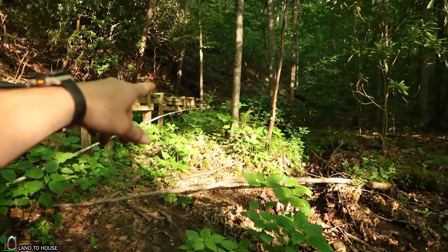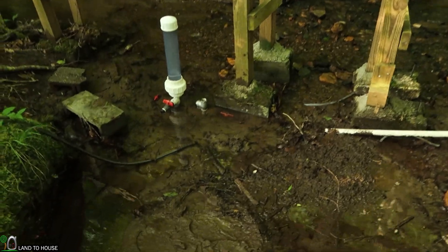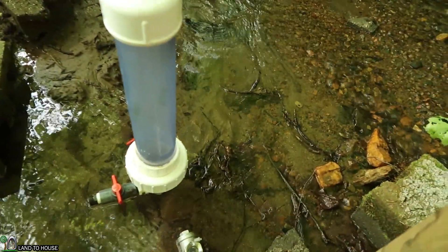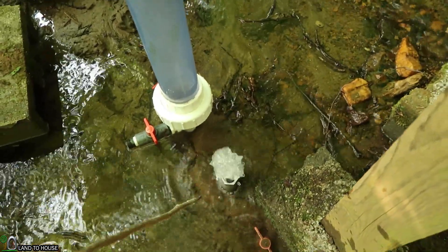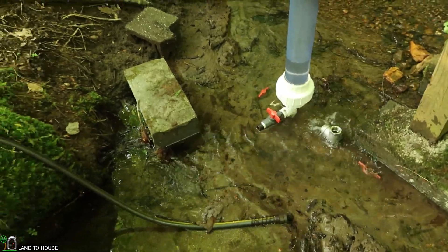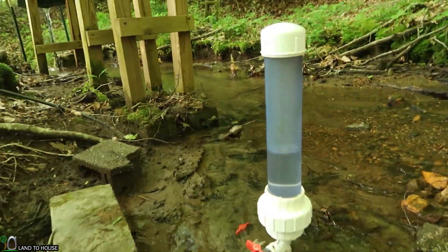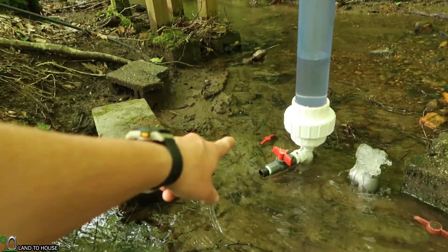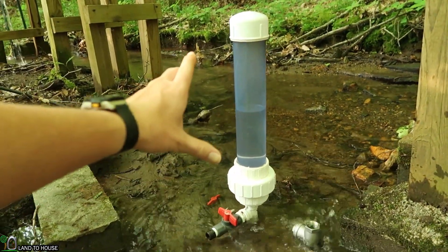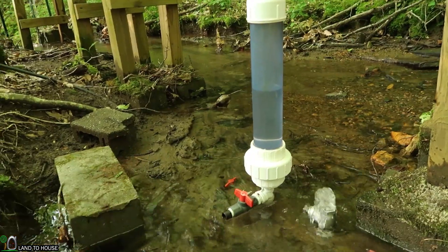In this case, I've got seven foot of drop, known as head pressure, coming into the pump, and there is a waste valve right here. When I push this, it will begin to cycle, and it builds pressure here in this pressure tank. I have a delivery pipe closed off, so it's just building pressure over and over again and not pushing any water uphill.